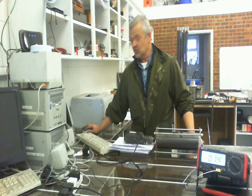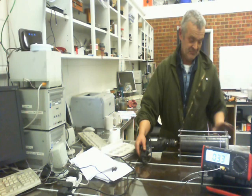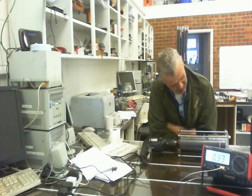Having connected the drill, I'll start the stopwatch and turn it over. After about four minutes it's raised the temperature from 13°C to 28°C — that's cool, it certainly works. After about six minutes it's at 33°C and feels warm to the touch. It's not particularly efficient for this little design, so I think I'm going to remake it using the interlacing discs — I found that really interesting, and I hope you did too. Thank you very much for watching.